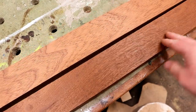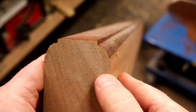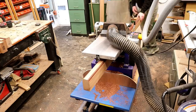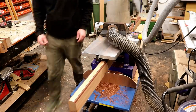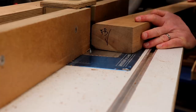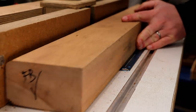This wood that came from the door I think might be mahogany — really nice looking once planed up. These pieces had a routed profile on the corners which I really didn't like, so I removed that first by planing away some of the material and then by fitting a chamfer bit in my router table so that I can add a nice chunky bevel to the edges to replace that round over.